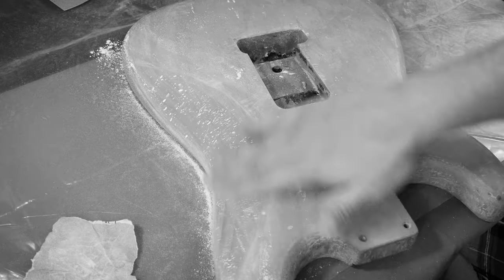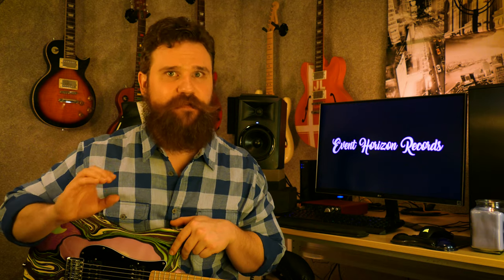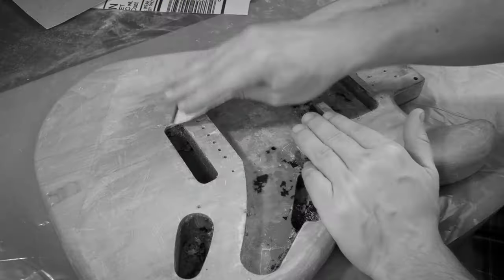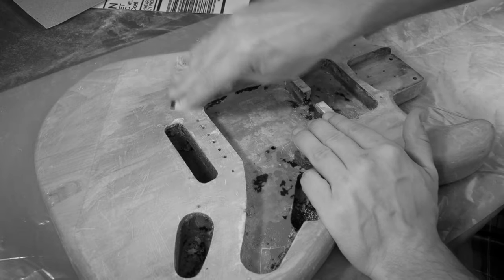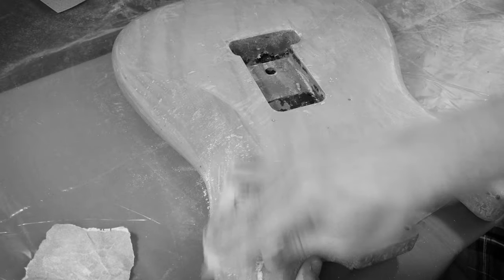Once we're down to the wood, go ahead and use some wood filler compound if there are divots and cracks. I didn't use it because the enamel paint's really thick and textured and we're using several layers of lacquer anyway to smooth it out. So it's not 100% necessary, but if we're going to do it right, might as well do it right with wood filler compound. Spackle it in there, sand it down, get ready for that primer. While we're on sanding, use a random orbital sander if you have one. I forgot I had one in storage, so I sanded by hand during one of the steps. It just makes things easier.